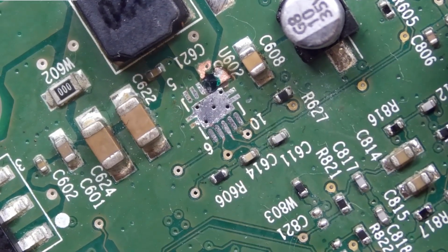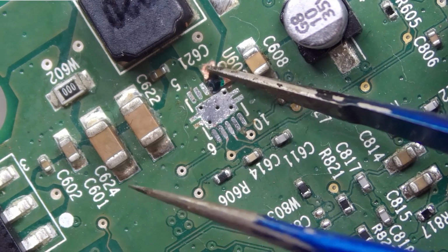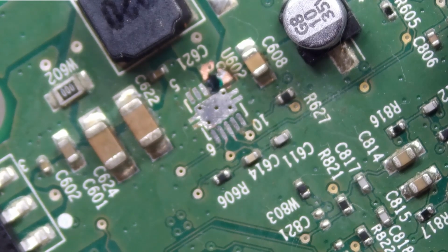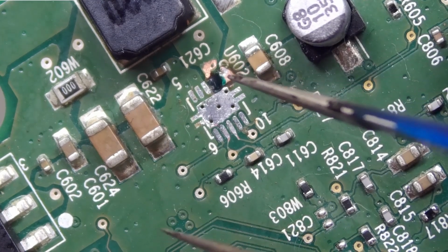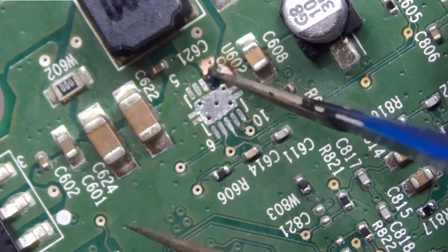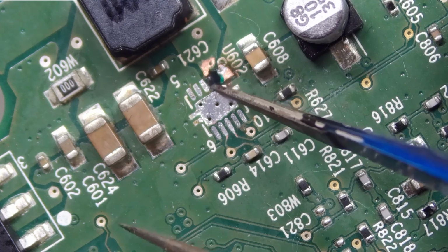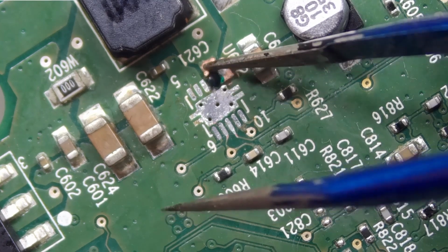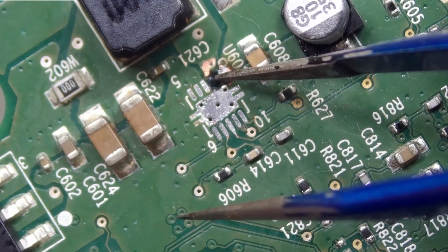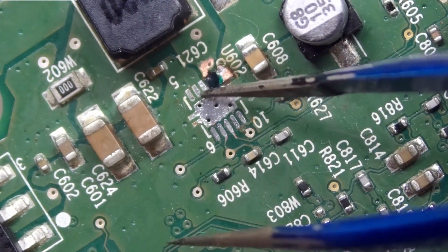One thing I'm a little bit worried about is how it exploded and caused damage. It might be pretty difficult to get the pin under here going. I put some solder mask here to cover up the exposed plane below it, but I have to connect this one right here to this edge pin, and then this one to this pin right here. So I'm thinking I'm going to get a little magnet wire, try and flatten it down and put it right here, and then the same for right here. And hopefully it's not raised up too high to where this can't all connect.